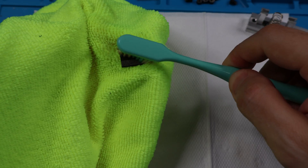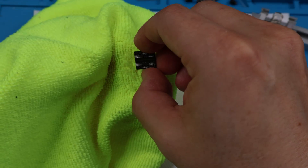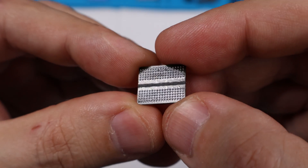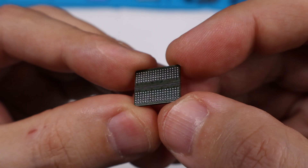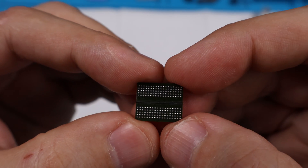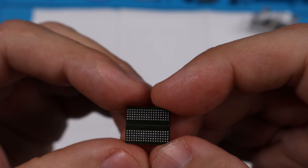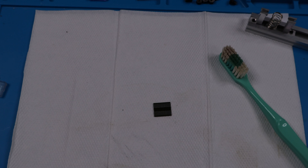The secret is timing — as soon as you get the heat off the stencil, you need to quickly separate the two, otherwise the chip will stick to the stencil and you will destroy the balls. There you go guys — quick and easy reballing. It doesn't take much time and you get it right the first time. All the balls are there, no tinkering with missing or moving balls. This is how I do my reballings for GPUs as well as memory chips — direct heat is the way to go. I hope you enjoyed the video, subscribe if you haven't, hit me with a like and comment, see you in the next one!